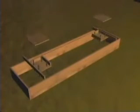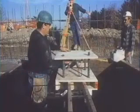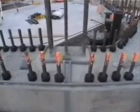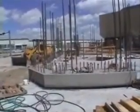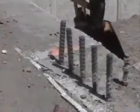When groups of bars are widely spaced, connect the assemblies for each precast panel. Remember to check the location by surveying the dowels both before and just after casting, as the forms tend to shift when concrete is placed. If the template assemblies have been properly located and checked, there should not be any need to move the dowels. Patterns as large as 50 bars and more have been cast with good accuracy. However, there is always the chance for error, so it makes sense to plan for some adjustment.